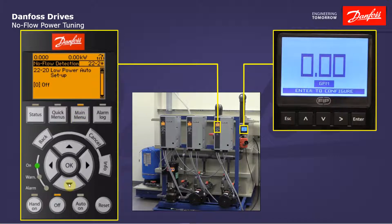I'm going to go back through a couple more parameters here and explain exactly what happened. Moving down to the next parameter: low power detection. This is enabled by default after executing the tuning sequence, and we need to have low power detection on in order for this to work. Low speed detection is not necessary — that's for detecting no flow based on running at minimum speed for a certain amount of time, usually applicable in a PID pressure application. For the no-flow function, in order to get something to happen when a no-flow is detected, we have to select a function. I'm going to choose trip. And then finally we have the no-flow delay defaulted to 10 seconds. This is the delay before the no-flow will occur — I have to be at or below the calculated no-flow power for 10 seconds before the trip will occur.